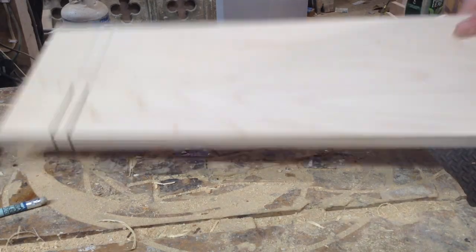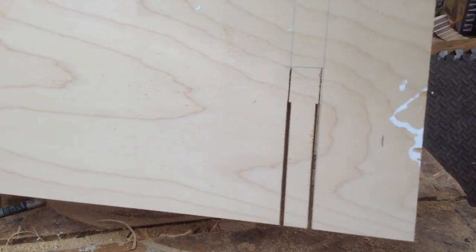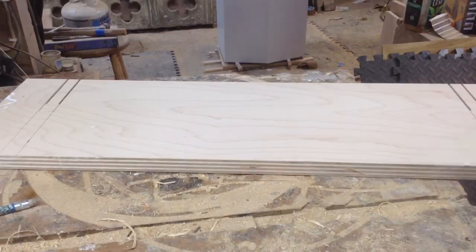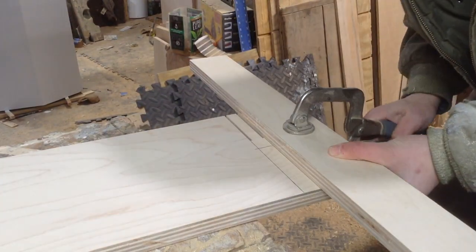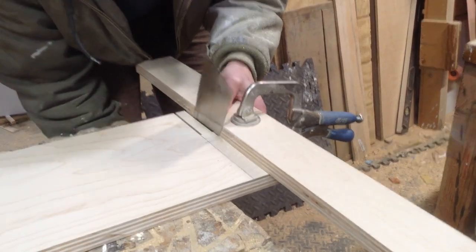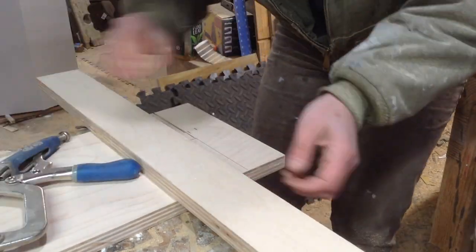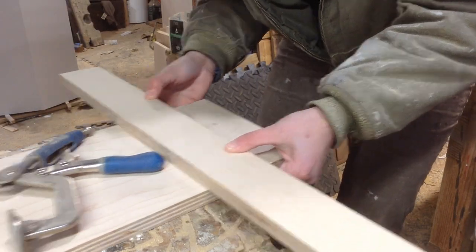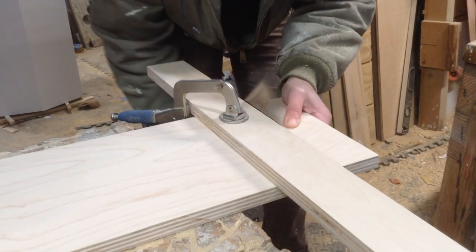You could see the marks don't necessarily line up with the tape measure at three-quarters, but they'll all be the exact same size. I decided to finish cutting these with a handsaw, clamping a straight edge as a guide and cutting up to my mark. A jigsaw or bandsaw would work really well here too — I just chose the handsaw to finish cutting these pieces.